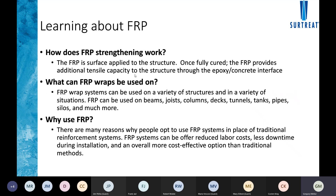There are a few different methods of application for FRP — it can either be wet layup applied or dry layup applied. At the end of the day it's a fit-over-function of how you're going to apply the product, but it'll service the same way either way. Typically you'll prep the surface of the concrete structure, grinding it down to a CSP2 surface profile — something almost like textured sandpaper, nothing too extreme.